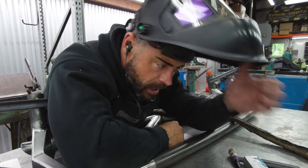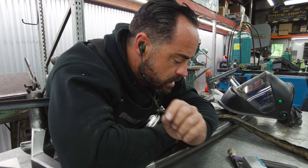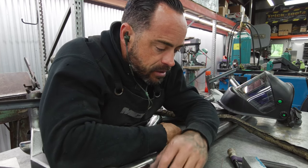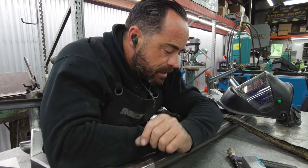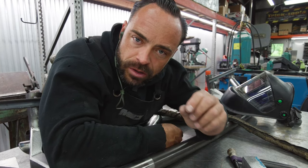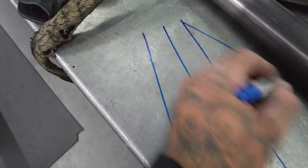Something else too that I press on for myself is really consistent tight spacing. I think it's a lot easier to make gapped out spacing where it's more like scaly or dimes, but consistency where it's tighter, I really believe is a stronger weld because there's no upset. Like, and what I mean by that, all right, so let's say this is your material.